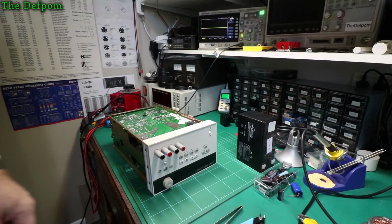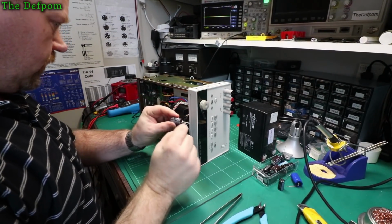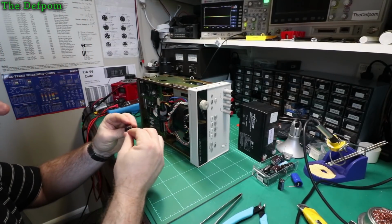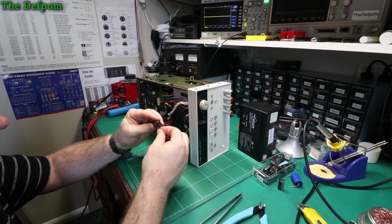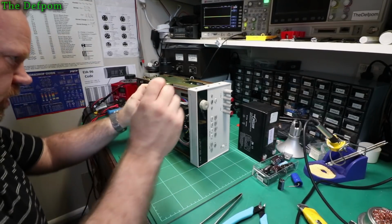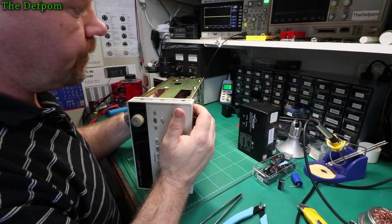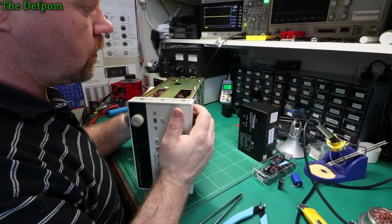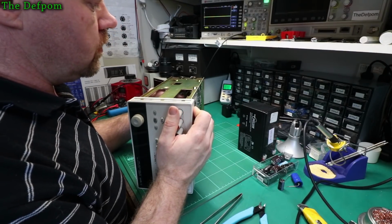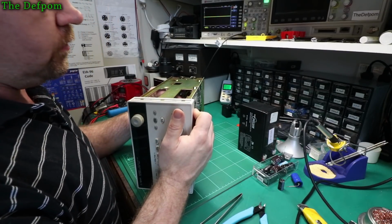Just check the chat out. Well, I'm going to go with this one, 2200 uF, 35 volt. I'm going to try and squeeze that in there, and hopefully I'll get the leads through the holes. They seem to be a bit close to the hole size, so I might be able to get them through the holes. But we'll see how we go. They may or may not fit. Oh, nice, going through. Cool. Excellent. I'm even putting it right around. That's always a good thing.